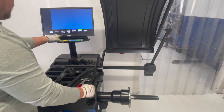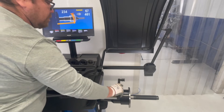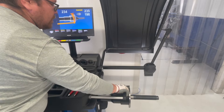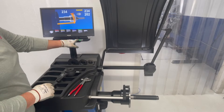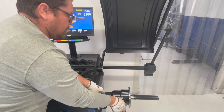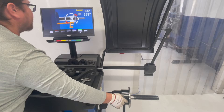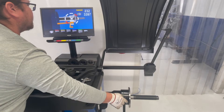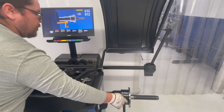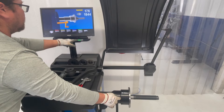Next we're going to do our distance and diameter gauge. Yellow button — manual distance and diameter gauge to the tip of that bell right there. Green button, just rotate the width gauge around, green button again, and then we're going to move the gauge down to the next shallow part of the shaft.